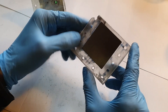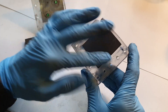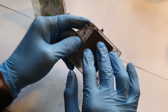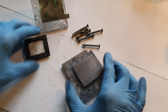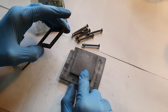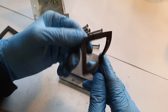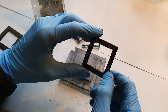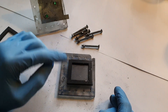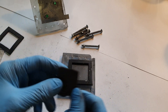Here is the positive electrode. Again I use an acrylic piece for the end plate, and into this acrylic piece I glue a graphite plate — this graphite plate is the positive current collector. On this positive current collector I add a piece of neoprene rubber, which will seal the complete cell. You can leave it like this, or you can fill this section with graphite carbon fiber to increase the surface area of the cell.